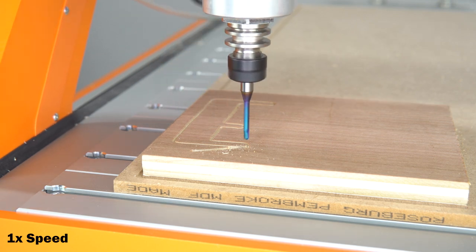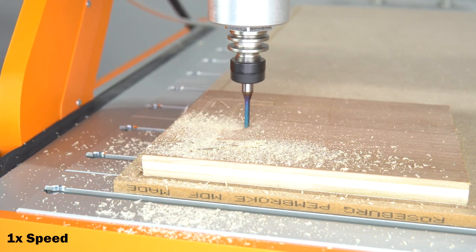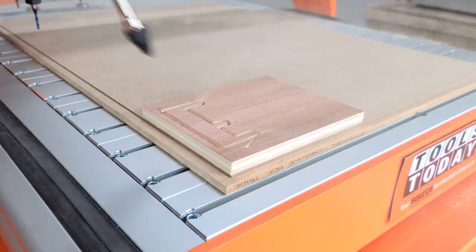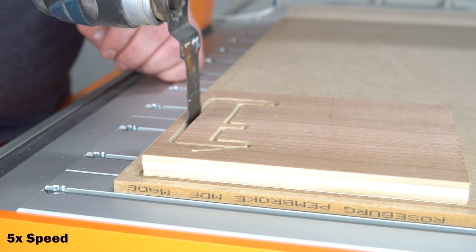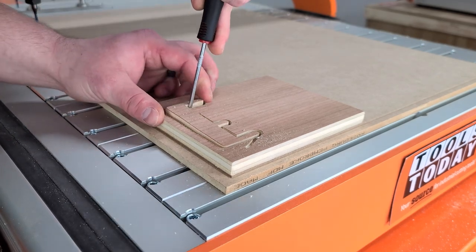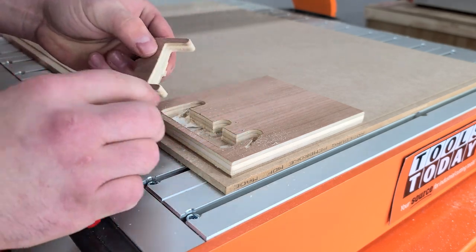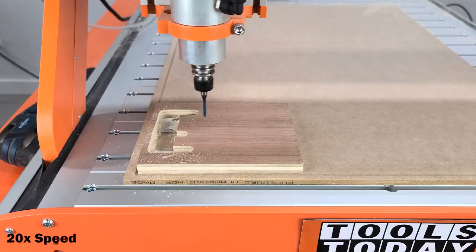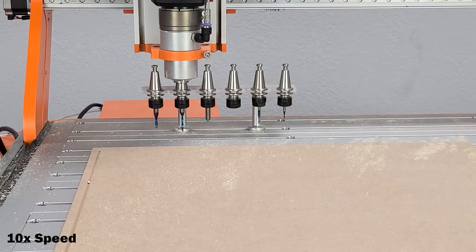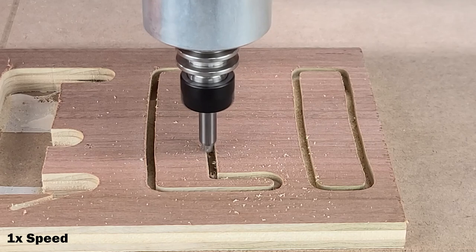We went through in two passes at a quarter inch depth per pass at about 40 inches per minute. With the compression bit, the up cut portion and down cut portion leave nice clean top and bottom surfaces — you just need to make sure that first pass is below the up cut portion of the bit. Using a multi-tool we got those tabs trimmed out. This plywood is paper backed plywood — just some scrap I had. The point round over bit is just a tiny little radius, but it leaves enough to break the edge, and it's a little easier to do on the CNC than on a router table since the piece is so small.